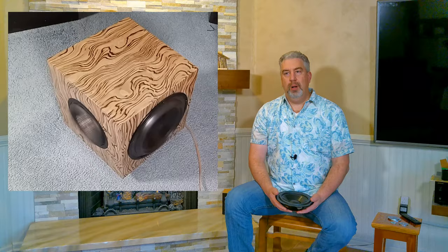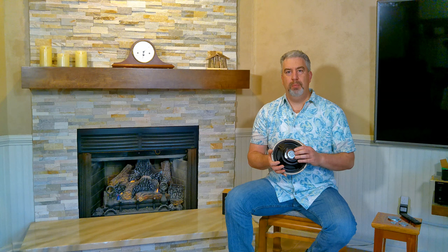I pulled it out. I immediately ordered another one, and that one has performed fine. Of course, I didn't add 120 grams. I only added 100 grams. As I redesigned it, I discovered that the F3, from being, I think, 36 hertz or so, moved up to 39 hertz if I moved the weight from 120 grams per passive radiator down to 100 grams.